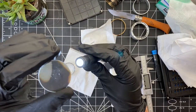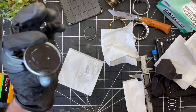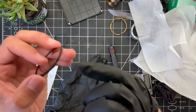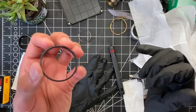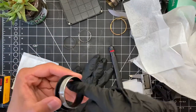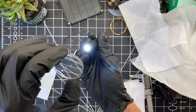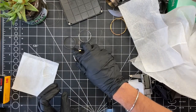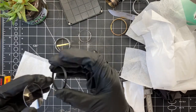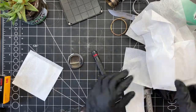You can see the lens has little bits of dust, but we'll worry about that afterwards — what we're really focusing on is any haze or fungus. This front lens looks really nice after washing and polishing with the Kim wipes. Once I had those lenses cleaned up I ran my finger across the lens assembly to remove any loose debris so it wouldn't get trapped between the lenses during reassembly. I'm doing a few more final inspections before beginning assembly — I'd hate to put the whole lens together and find a huge speck of dust inside. I then popped in the outer lens, placed the inner lens inside its mounting ring making sure it went in the right way, and began tightening the outer ring.